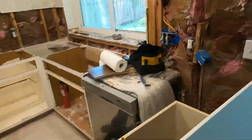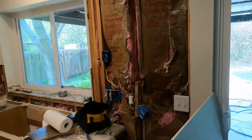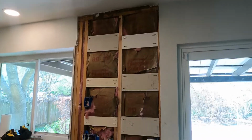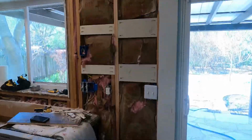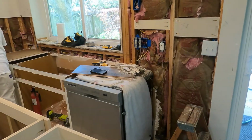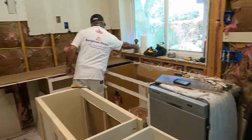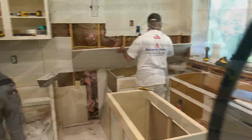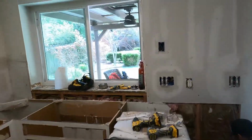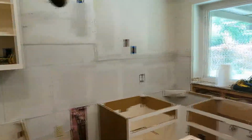We are done with the closet as far as all the sheetrock and drywall, so this is going to be their new pantry closet, and we're going to install some shelves later on the next video. Also, you can see here where we are sheetrocking, this wall right here, that's where the termite damage was, so it turned out everything was good, no big deal. So we just removed that stud and we added new blocking for the shelving that we're gonna have in there. It's actually gonna be some floating shelves in there, and also that'll be on the next video coming up.